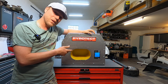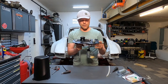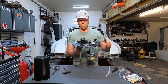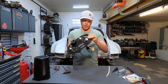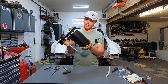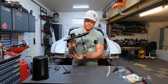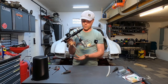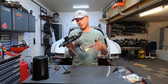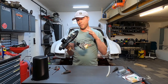Something needs to go in the place of that hole — and here we go, this is the fuel cell unit. This one has all the pumps and all the goodies attached to it. Fuel comes out here and returns to the tank through this attachment. This is a vent line. This is where you fill the fuel, and here you can put a fuel gauge. On the bottom you have your primary fuel pump — this is what pumps fuel over to the engine. It's housed in a 2-liter surge tank, and on the side you have a lift pump that goes down into the very bottom of the fuel tank, lifting fuel into the surge tank so it's always full — even when the main tank is nearly empty. This enables you to corner at full speed without much fuel left.